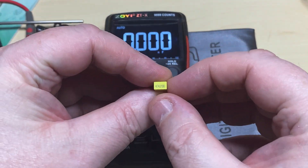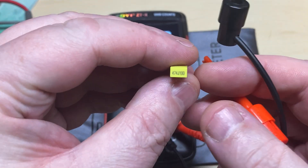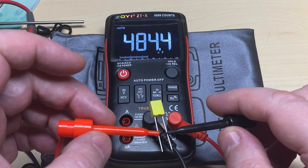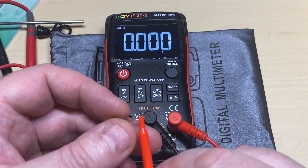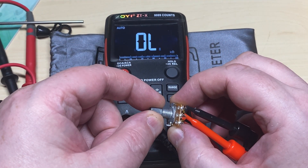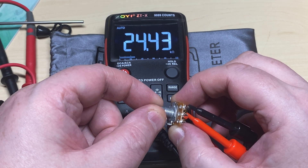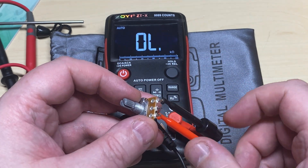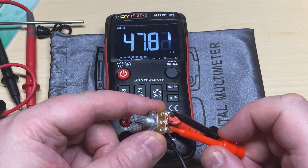We've got a capacitor test on this — let's read this capacitor. Yep, seems good, seems pretty accurate. That capacitor reads nicely too. That shows how quick it responds to a variable resistor — no problem. The update on the display is very quick on this. I think this is a 50k pot — with it being a B pot, it's a linear pot, not a log pot.